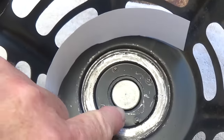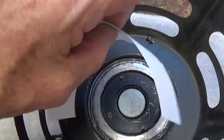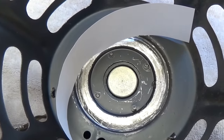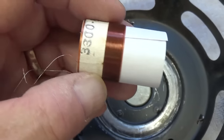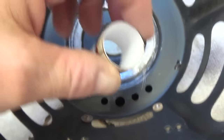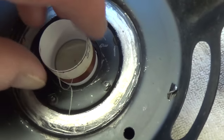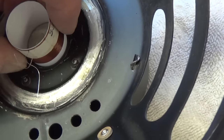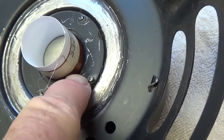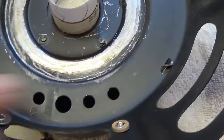I'm going to make a shim that's going to space the voice coil an even distance all the way around the pole piece. For this particular speaker, two layers of typewriter paper is going to work — this is going to wrap around twice. For bigger gaps you'd have to use thicker material. Roll up your shim — one ply if you use thicker material, or two plies in my case — and be sure that the wires that exit from the voice coil align with the terminals of the speaker. Then put the end of your shim over the pole piece and slide it all the way to the bottom of that cavity. Slide the voice coil downward around it until about two of the windings are visible above the edge of the speaker basket. Now we've got our hair-like wires aligned with the terminals of the speaker basket, and just a tiny bit of the voice coil visible above the edge of this plate.